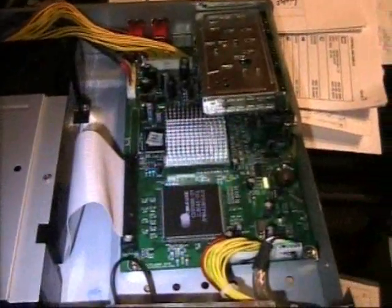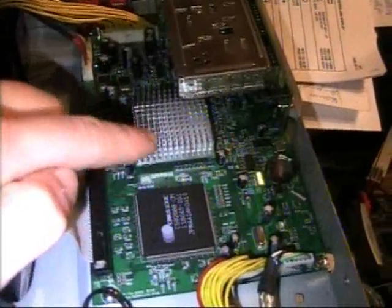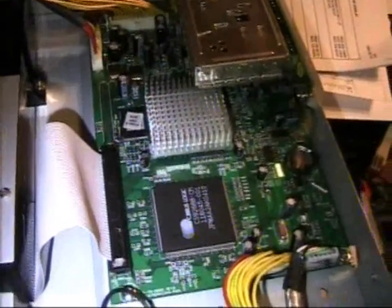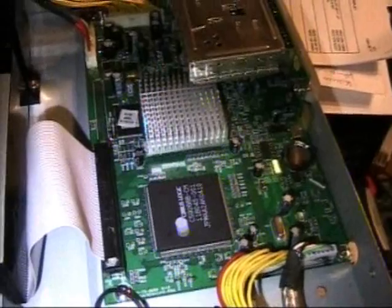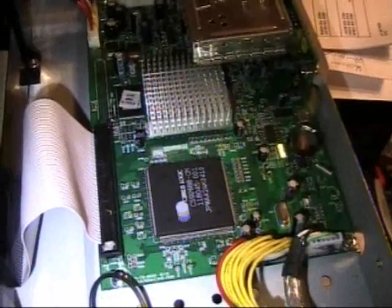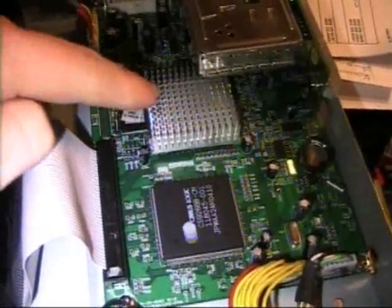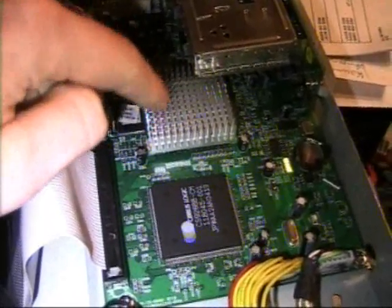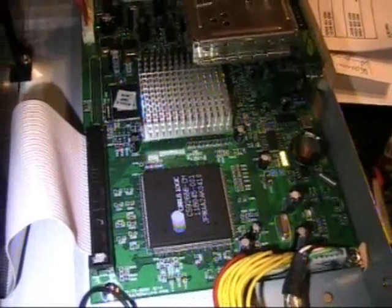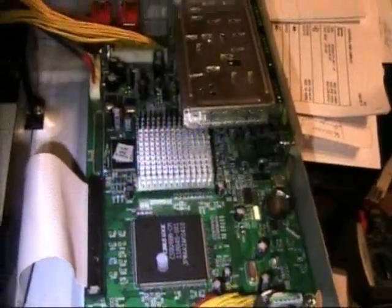This is the main circuit board, and this is containing two processor chips, as you can see. And this, which must be the one for playback, was getting incredibly hot during playback, I can tell you. So I took an old motherboard and took off a heatsink, and using some heatsink grease I just stuck it on here. It's holding on pretty well. And that chip should have a much longer lifetime now.